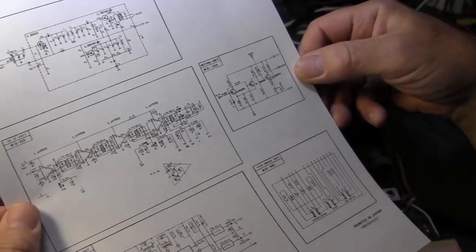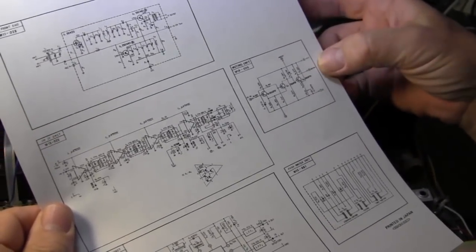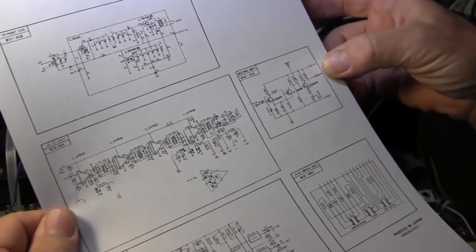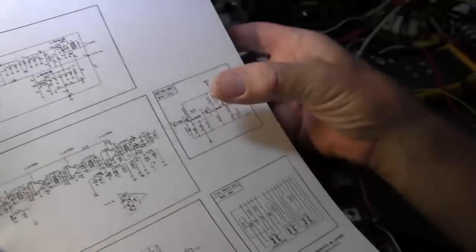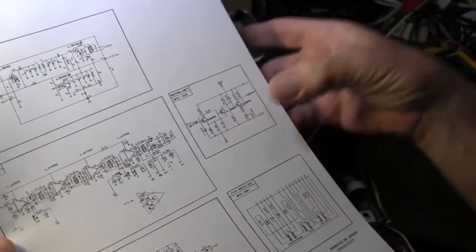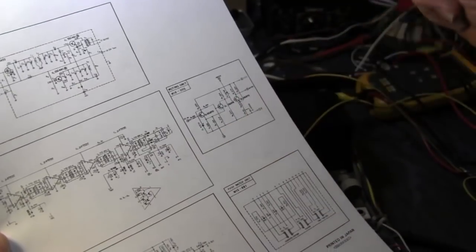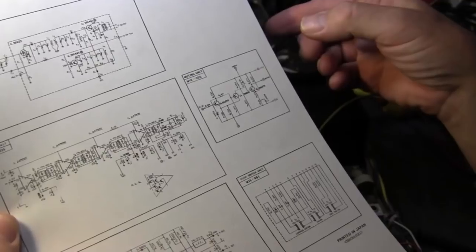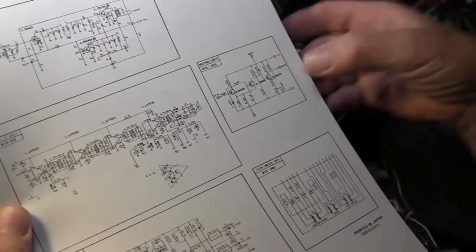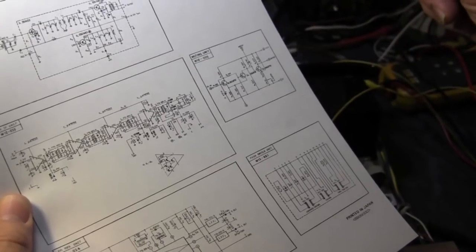So it's got three transistors, two capacitors. Input, output, this is where we've bypassed. And muting voltage. It says DC in and switch, so I'm assuming there's a voltage derived off the IF and there is a switch to control it. So the voltage off the IF is an indicator of whether there's a station or not. Right, and there's probably a threshold adjust right there. And you kind of had to match the dots on this.